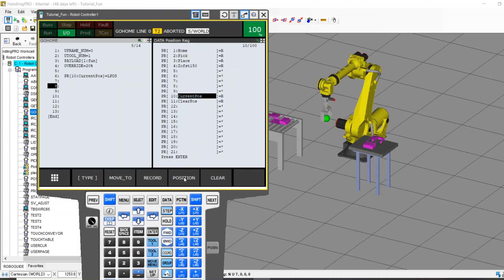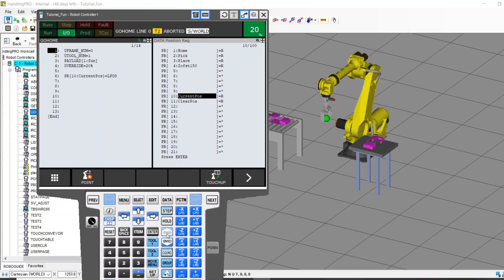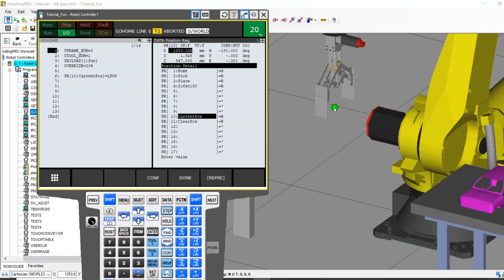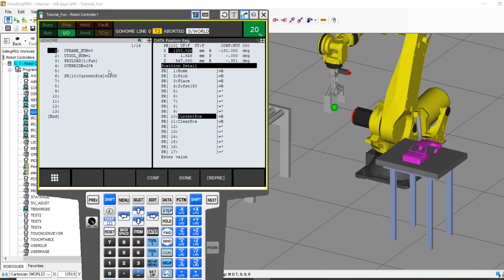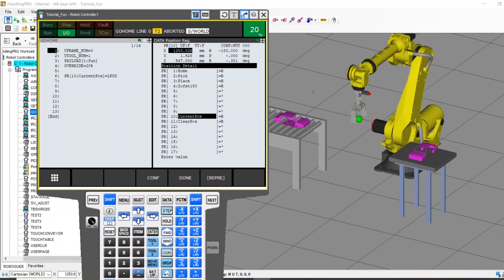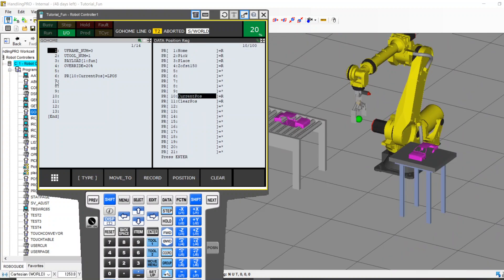Now we have that information. If I go over here and look, you can see it's all zeros right now. If I just go ahead and run this code with shift forward — there we go. It updated my zeros and put the position of the robot — XYZ Yaw Pitch Roll — to tell me where that tool tip is. Remember, it's going to be tool 1 in world frame. So tool 1 in world — where is that tool? Good, that works.